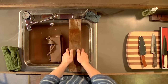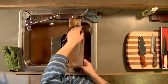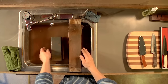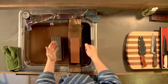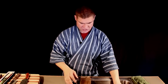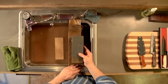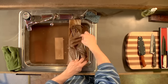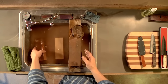The next thing, once you get your wood measured and in place, then it's nice to take a cloth of some kind. This cloth is going to become trashed after a few uses, so don't use your best linen. Now the cloth is going to provide a stable base for your stone to sit on, so that as you're sharpening, the stone doesn't move backwards and forwards, and it makes a nice safe situation. Today, because we're filming and we're trying to get over the height challenge here of the sill there, I've taken one of our other sharpening stones, because of its size. This happens to be a natural water stone from Japan, and I've just put that there to give me a little bit more height, make it for a base. So I've then folded over this cloth so that I can put my other stone on it.